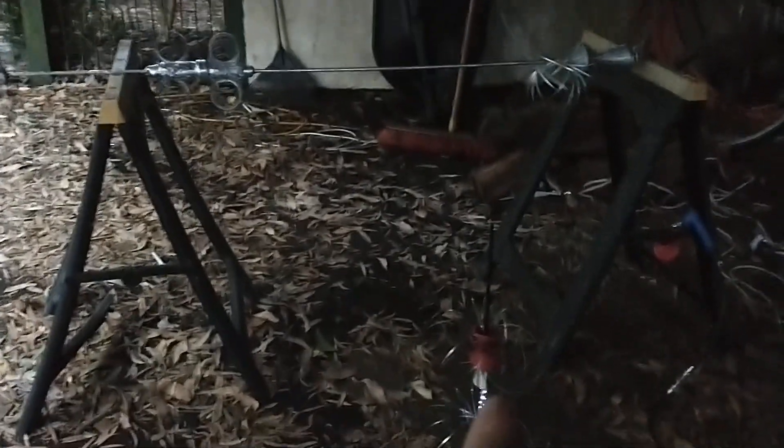There is something else I should point out. Even what we're observing here is less than it would be in a proper operating condition, because a lot of the E-fields are leaking off into the ground. This part I'm holding is non-conductive, so this is picking up the E-fields, as you can see. Now, if I place this down on the ground and let go of it — it's just on the ground beneath the antenna — and it's being illuminated because of the E-fields ducting down to the ground. I'll move it a bit away, and again it's still illuminated because the E-fields are seeping off to the ground.